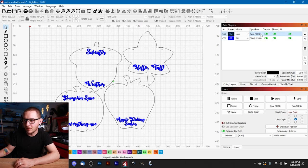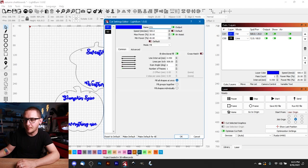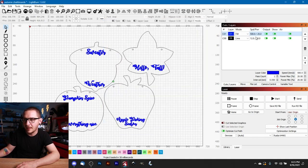Here's our file. The first thing to look at is our settings. We have our cut line, but we actually don't want that first - we want to do our engraving first. We've got a speed of 500 and a power of 20, and that's going to give us the perfect mark on this chalkboard. If we open it up and check the resolution, in order to get just the perfect mark at least with my laser, you really need a DPI of 500 with a line interval of 0.05 - this really does the trick.